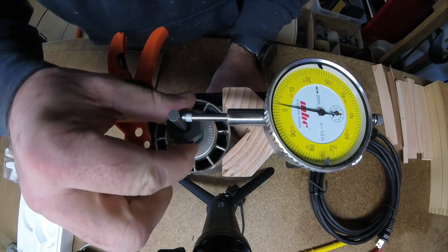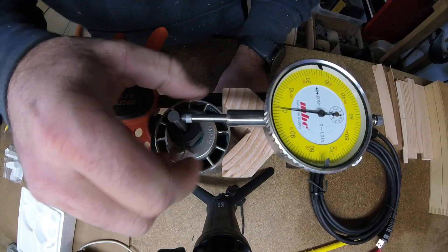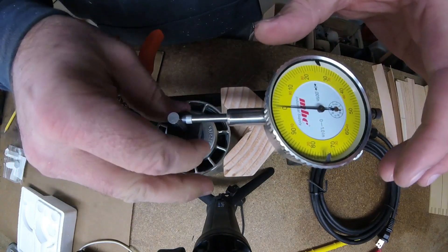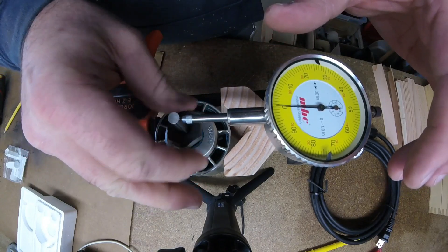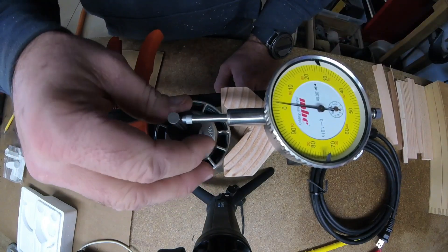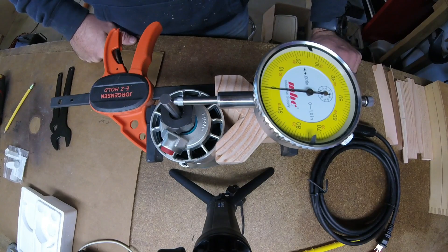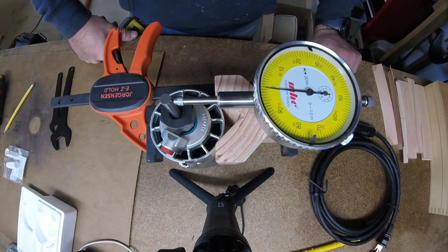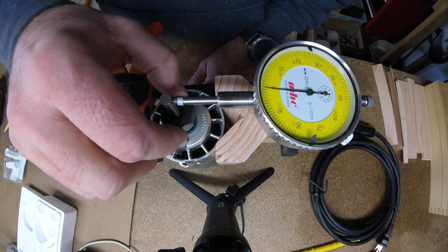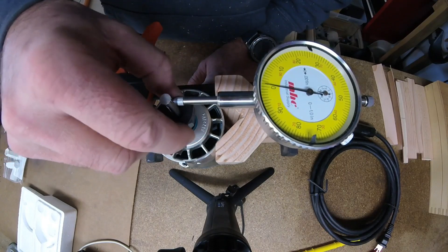One thing we can do is give it a little bit of a slop back and forth to try to get it to center itself, then tighten it up and rotate it to see what the runout is. Get it nice and snug. Looks like we are zeroed up. Give it a gentle spin — that's not terrible, it's about what I expected. We're not talking about high-dollar precision bearings or commercial CNC quality stuff. That's about three thousandths runout, which isn't terrible. After remounting the gauge pin a couple of times and trying different things to get an average, the best result I could get is actually pretty good — just under plus or minus one thousandth of runout.